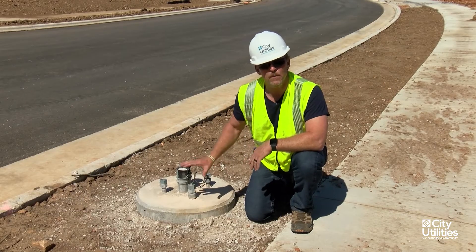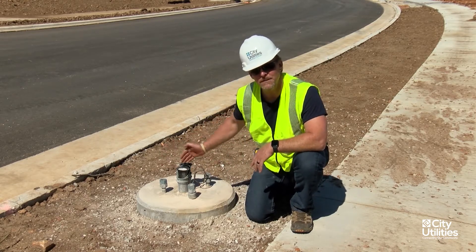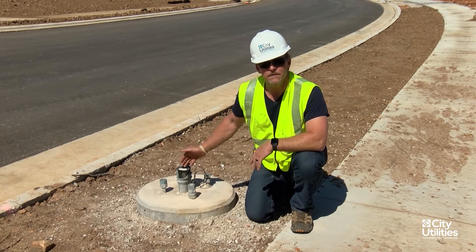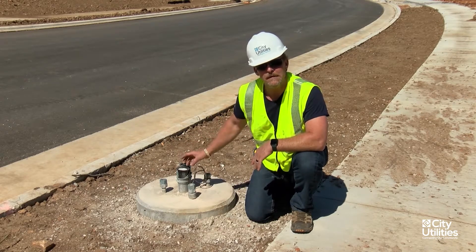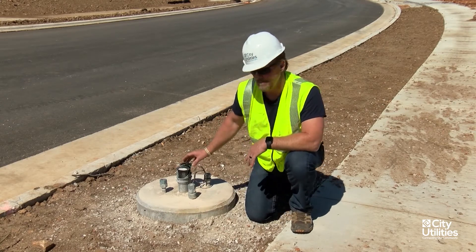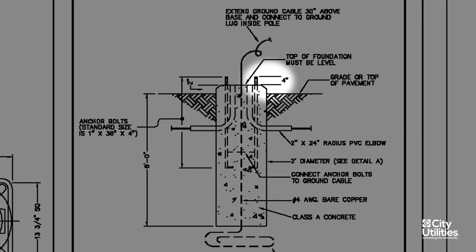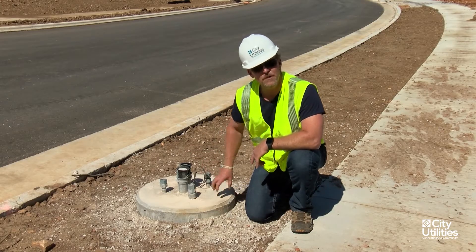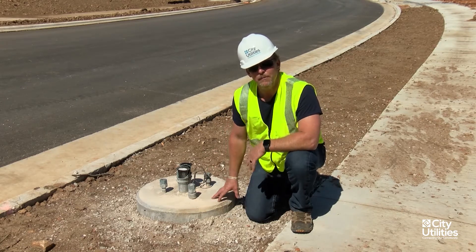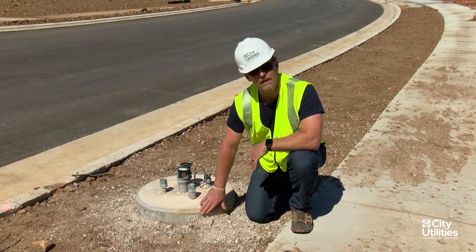So this here is our end game — here's what I want to see when we show up. Our standard would call out a 12 and a half inch bolt pattern measuring across the sides. This one here is actually 11 inches, because there's a different type of streetlight base being placed in this location — get with your engineer and he can tell you what size and where. Our standard would call out the threaded bolts to be four inches sticking above the finished edge of concrete; this one's three inches. Get with your engineer and he'll call out the proper distance. That's really probably the only difference on this particular streetlight base, but all of them have a little bit of a different component. Our standard is what we're talking about today. This concrete will stick two inches above grade, and you'll see this beveled edge here also.